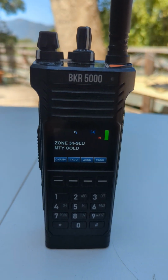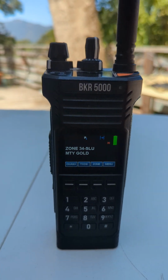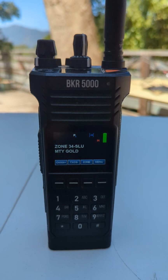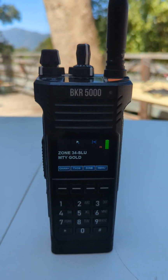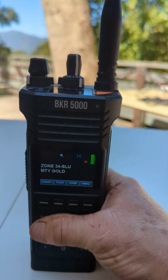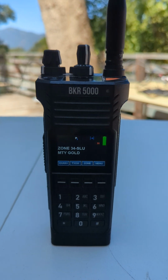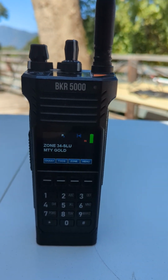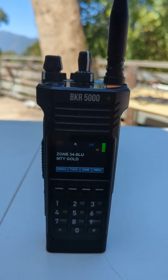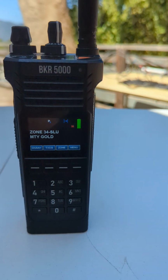If you got interference or degraded signal, the weather channel is my go-to without pulling out test equipment to see what's interfering. I'll go to a weaker weather channel and just kind of wave the radio around what I suspect. LED lighting, all the electronics that are in the vehicles. And you'll see the signal strength pop up if you hold the monitor, or if you're on the weather channel.